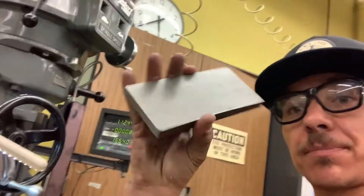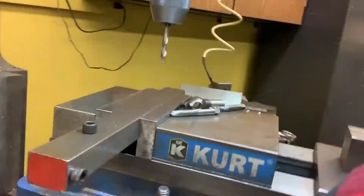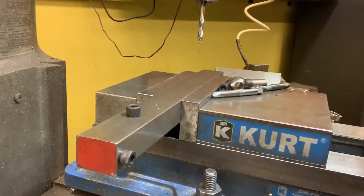More in the quick change die saga. I've got all my tenons cut and all my plates cut, which I didn't show — it's just a long boring process of setting up a horizontal and doing the same cut again and again. I deburred them all. Now they've got to go together and I'm going to have to weld them, so I could just set them up individually or waste a lot of time and make a jig. So we're making a jig.